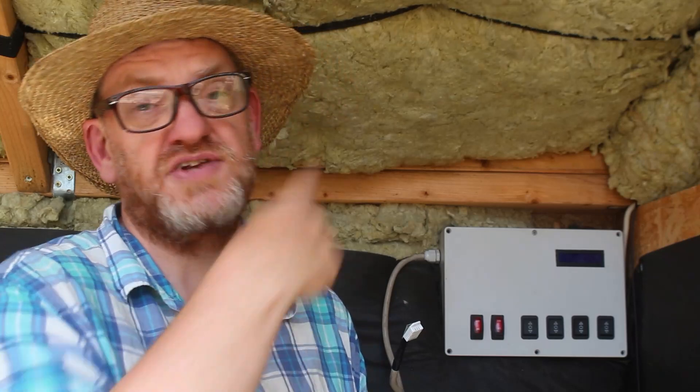It would get stuck in a loop of attempting to connect five times, then resetting itself. I solved the problem of Wi-Fi connection by putting the antenna out here, extended from up in the loft, and that allows all the devices in the garden to connect. But what I didn't appreciate was there was a problem with power. When the device was switching on Wi-Fi, it was lowering the power and then it couldn't connect — it was intermittent. It seemed to be better when things were cooler. But yesterday, the moment I took the Wi-Fi connection routine out, it functioned perfectly.